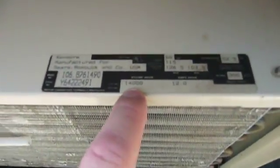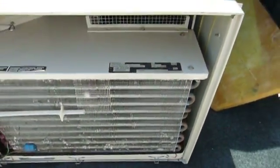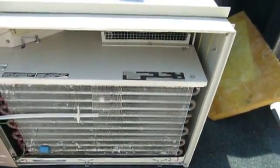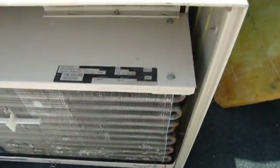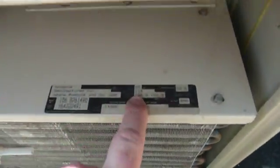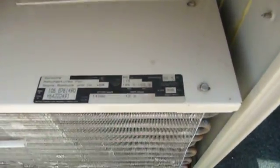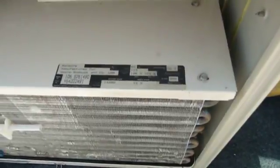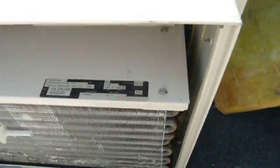But look at that BTU hour rating. 14,000 BTUs worth of output per hour. Folks, that's more than 1 ton's worth of cooling capacity from this unit. That's pretty amazing. What's even more amazing, you'd think this was a 220/240 unit. It's not. Runs on 115 volts AC, contains 52.5 ounces of refrigerant 22.